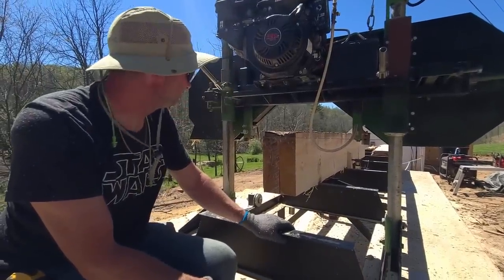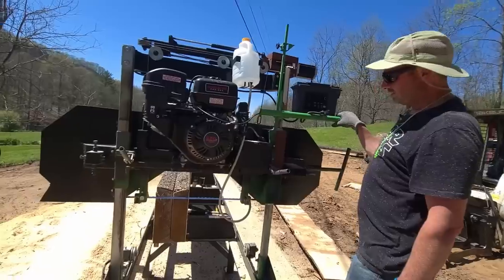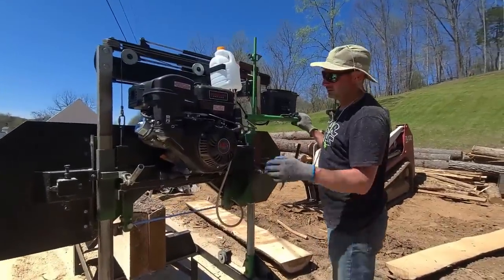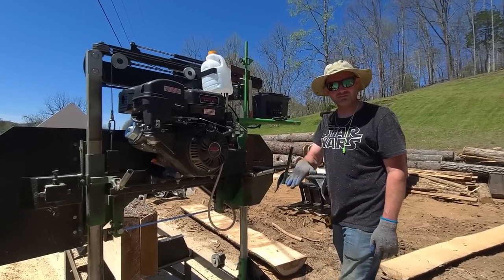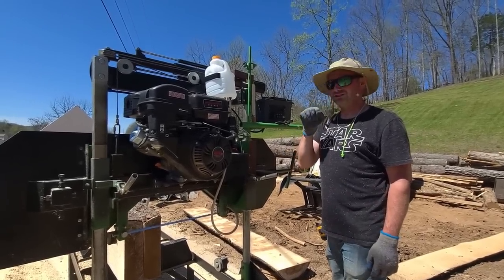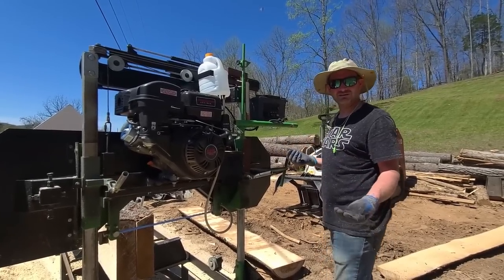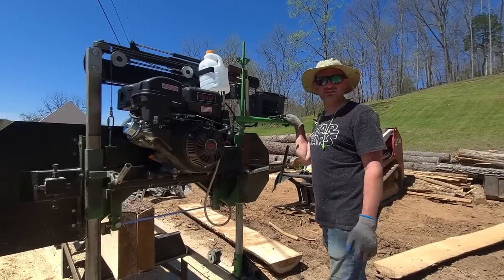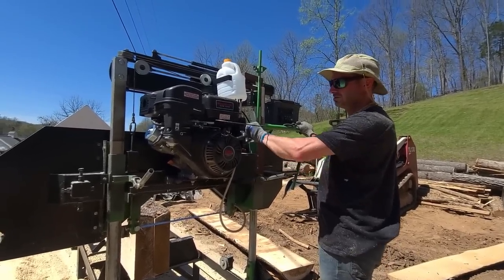Yeah, let's do it. Show you the clockwork where this thing comes into play. All right, first thing we're gonna do is zero this out. Zero, we got a green light. When I go cut, I'm gonna get these off, pull the saw back, and then we're gonna hit next. It's gonna drop down for the inch and a half we need for the 2x4. But the inch and a half, it's actually an inch and 9/16, because we calculated the shrinkage. Okay, let's do this.